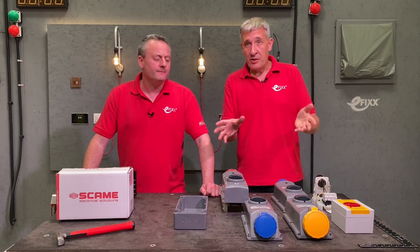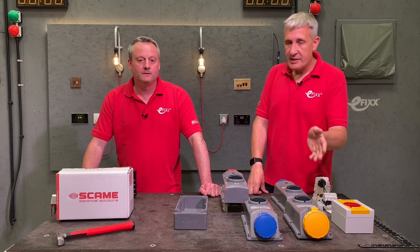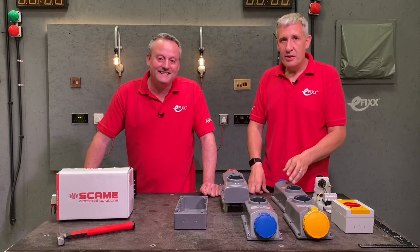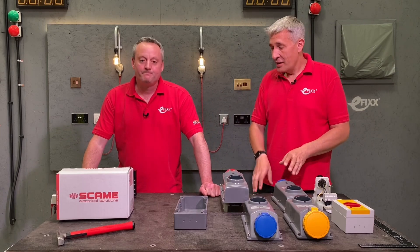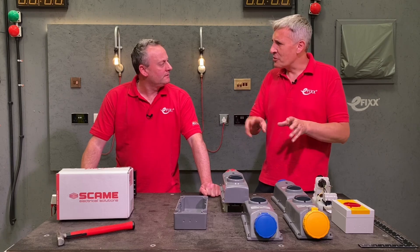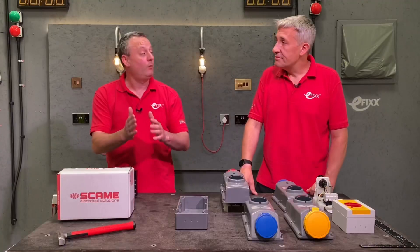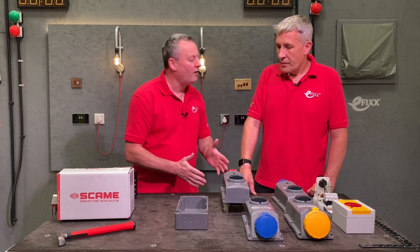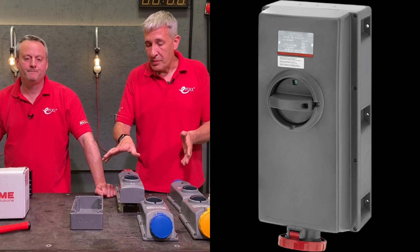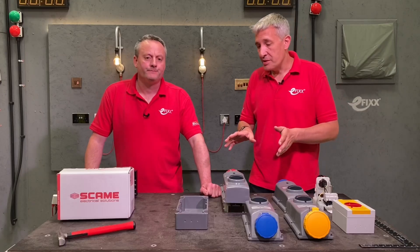This range has got everything you'd expect with this type of industrial product. Obviously the colour dictates the voltages, and we've got everything from 110 up to 400 volts, with all the different phase arrangements. Current wise, what range do we cover? 16 to 63 amps — however, you can also get a 125 amp version which looks slightly different. The 16 to 63 amp units all come in this common back box assembly, while the 125 amp has a different back box arrangement.